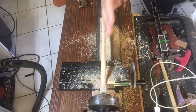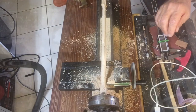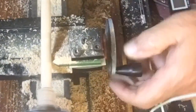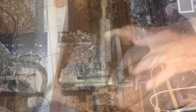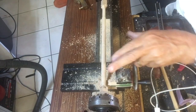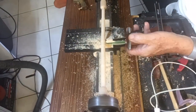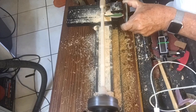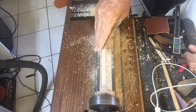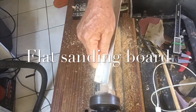The wheel is going to be pushing the cutter this way, and we're going to be going in very, very slightly all the time. We've got that almost down, sandpaper is going to take the rest of it, and now we're going to start from here and come down to this one. The more you try this technique, the better you'll get at it. If you're nervous, it's better to leave more on a piece and take it down with sandpaper as you go along. It's simply a technique that you can easily master.